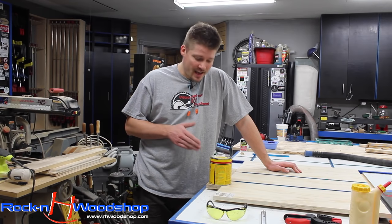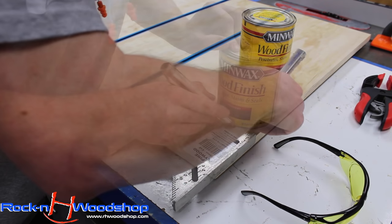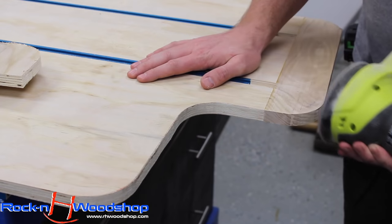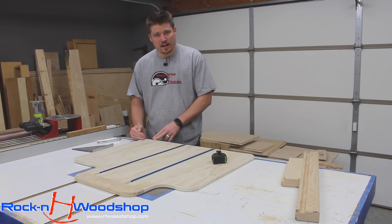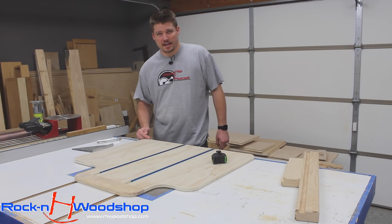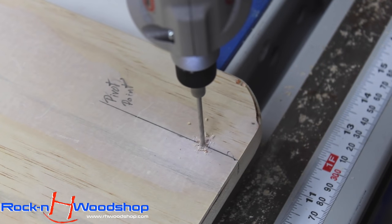From my previous sled I had some curvatures around the front just to take off the blockiness of the plywood. The easiest way to do that for a simple pattern is to take a quart-sized paint or stain can and use that as your pattern. I measure two inches from the side — I've got an inch overhang from the edge of the sled to the edge of the fence. Then I measure half the thickness of my fence from the back edge of the sled, which is three-quarters of an inch, draw a line across those two points, and that becomes my pivot point for squaring up the fence.